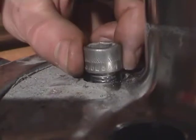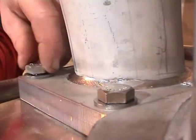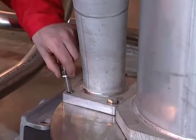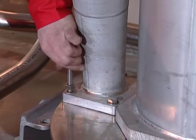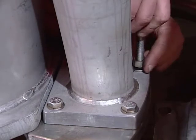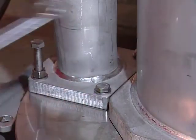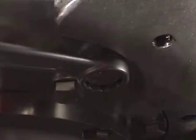When the pump impeller is loose, remove the bolts. Then remove the bolts between the volute casing and cargo leg. Exchange two of the bolts with lowering lifting bolts, one bolt in each leg.